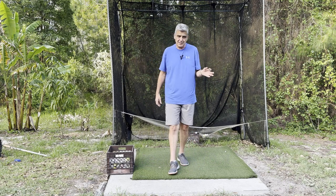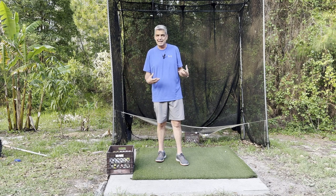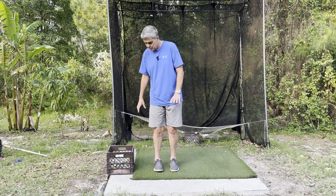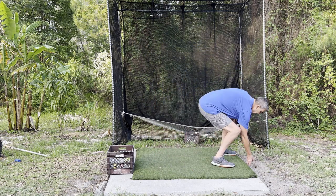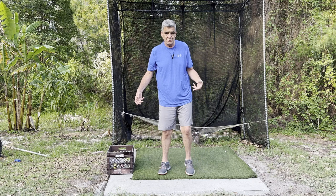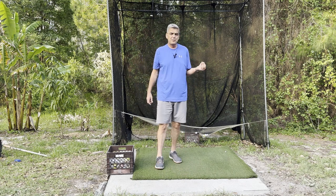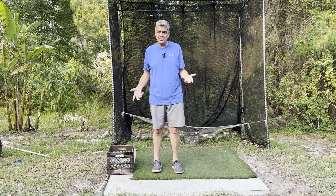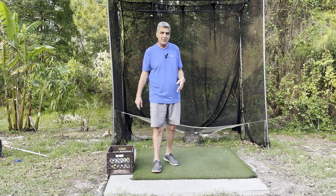Another beauty about this that I didn't mention is you don't have a bunch of unused wet concrete when you're done that you need to clean up and dispose of, because you use exactly the amount that you need. When you look at this close up you'll see I got a little bit of extra stuff around the edges — that can easily be picked up and I'll clean that up later. So that's the screeding. There are great videos online — look for Cajun Country Living. It's a guy and his wife, they do a lot of dry pour projects and they're really thorough in how to do it. So it's really cool. Let's get on to the next part of the video where I test it out.